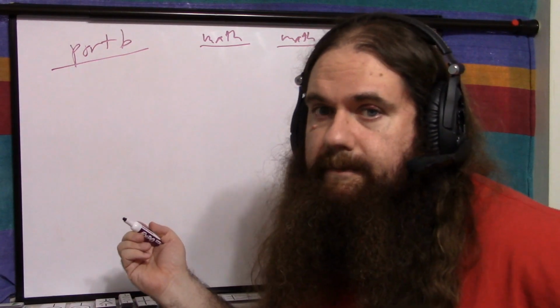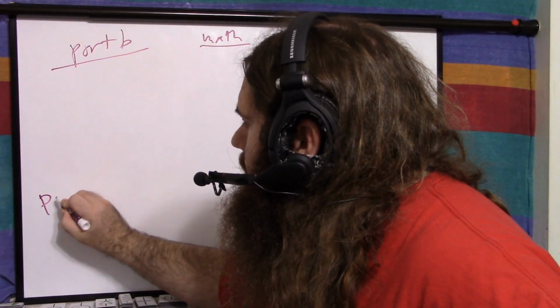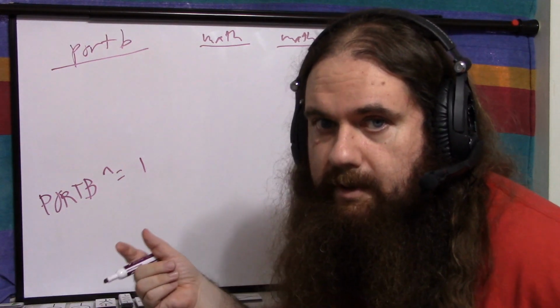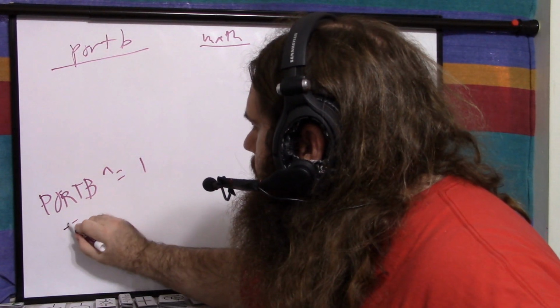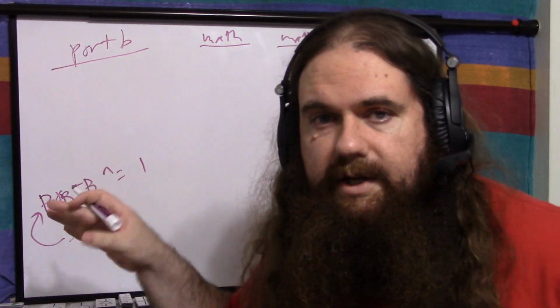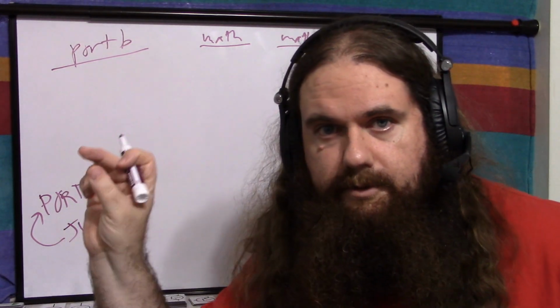So let's say my instruction is port B, XOR with 1. This flips the first bit, the lowest order bit, and then jump. And we jump there. Just do it over and over and over forever. We don't even check a condition. We just jump. It's like while true in code.